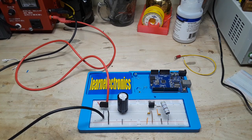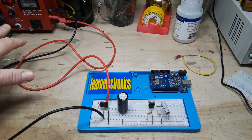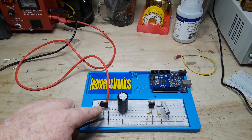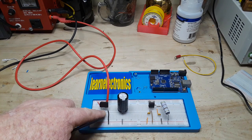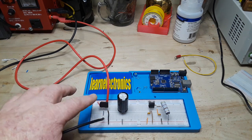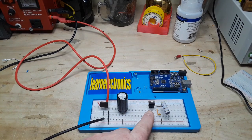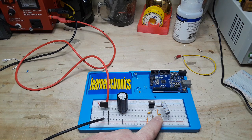What I've got set up here is simply a little DC power supply. We're using the variac to output 9 volts AC into this bridge rectifier. The AC goes into the two center pins — positive on the left, negative on the right. That output is filtered through this 3300 microfarad capacitor into a 7805 voltage regulator, with a 0.22 microfarad cap on the input and a 0.22 microfarad cap on the output. We're just using this 470 ohm resistor for our load.